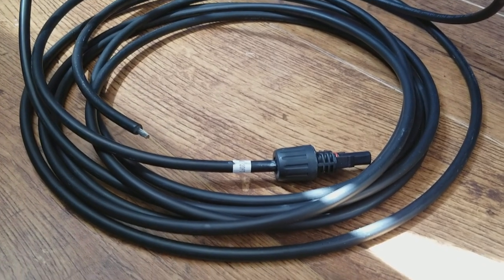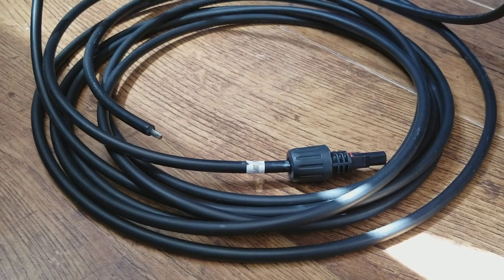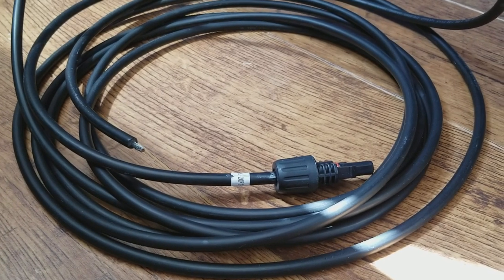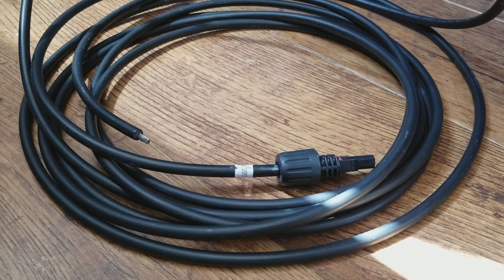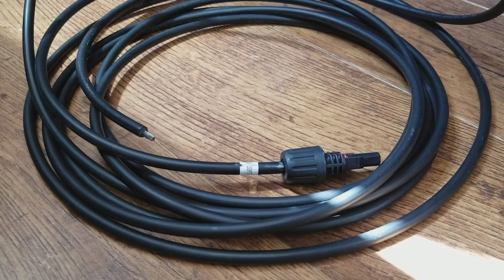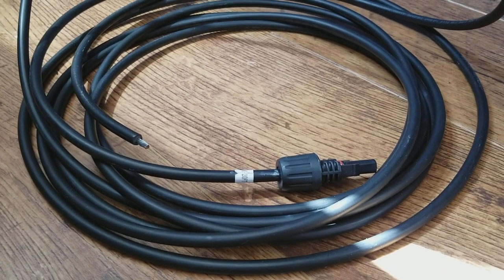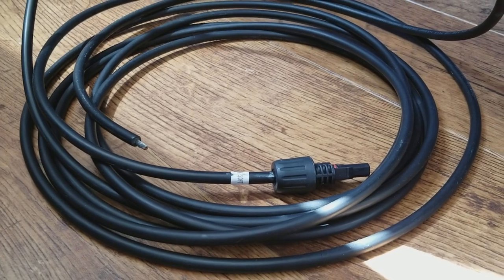So that's a quick overview of these cables. I used a 40-foot 10 AWG — it's working okay, I probably have some power loss, but that's something I can live with. There's a good calculator on Renogy's website that'll tell you exactly, for your length of cable, the voltage of your system, and your acceptable power loss, what AWG rating you should choose. If you found this helpful in any way, please subscribe to my channel — thanks so much.